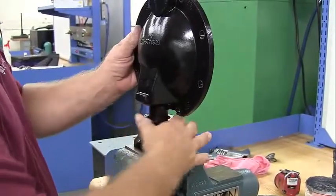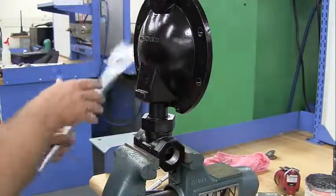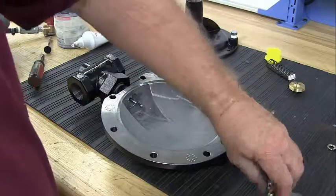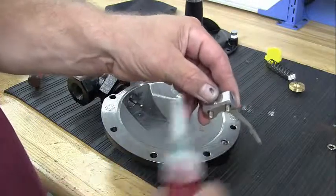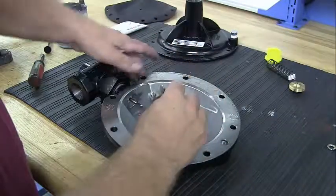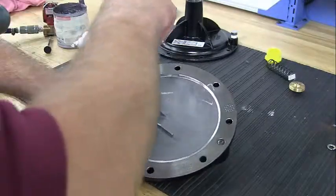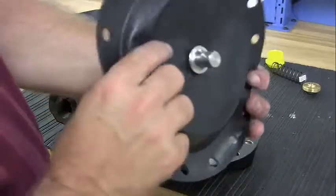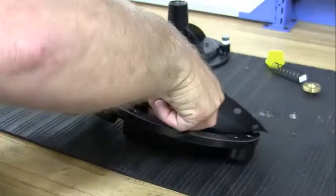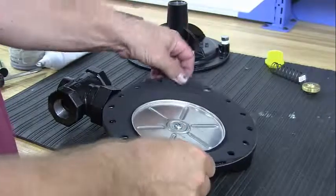Screw the body back into the actuator with the union nut and tighten with your 18-inch wrench. To replace the lever arm, first apply Loctite 290 to each of the screws. Place them back in and then tighten up while putting pressure on the block. Next, install the new diaphragm assembly. Line up the holes on the bottom screw so that it goes through the lever arm. The diaphragm should still be loose enough so that it can move up and down slightly.